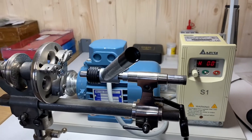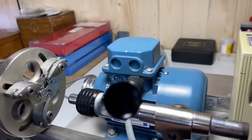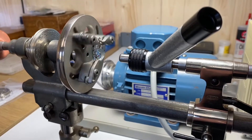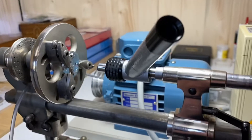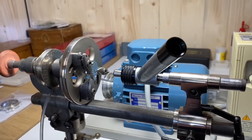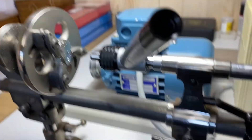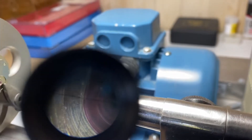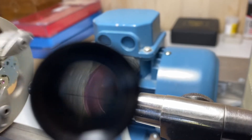The purpose of the centering microscope — it has crosshairs that you line up with the edge of the jewel, the inside of the jewel, not the middle, but with a known reference point, and you spin the piece and see if that point doesn't move. We'll look at why you don't just start drilling when you've roughly found center with a pointed object. And my lathe belt just broke — we'll do it without the lathe belt for now, we'll run it by hand. Here's why — does that look centered? Definitely not.